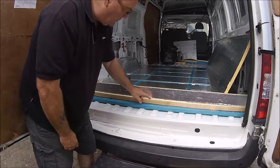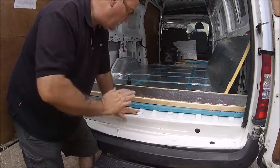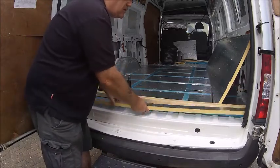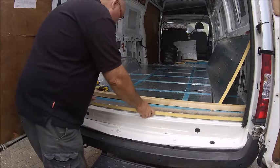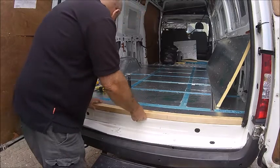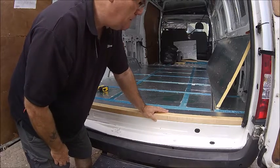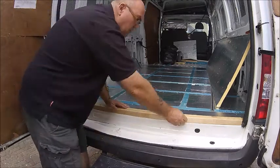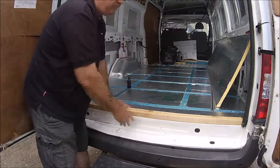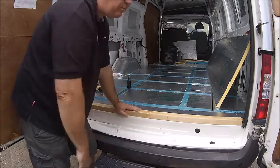I had to get it cut as close as possible, then I've had to use a planer to bring it down right, cut some insulation to go across the back there, and that timber then sits in the back flush — flush-ish. The floor will come up to there and then I'll put an edge strip in. When the doors are shut there's still a gap, but that will probably be glued in there and then the floor ply will hold it in place.